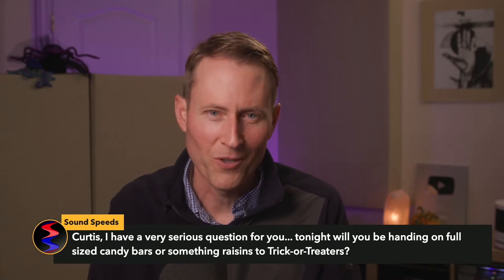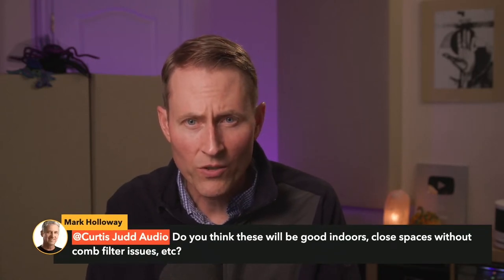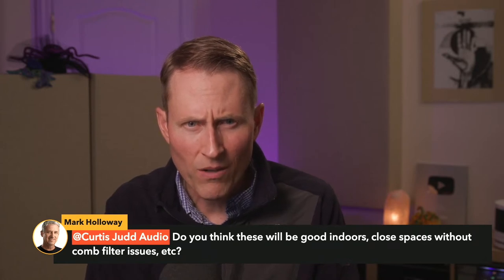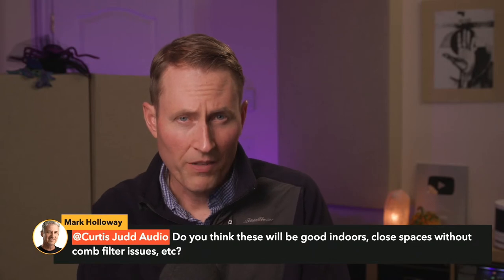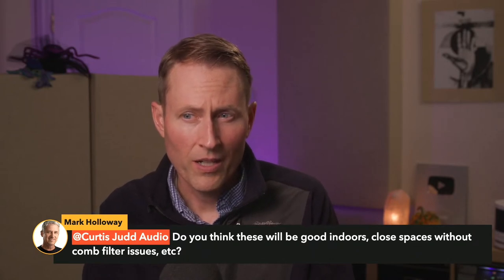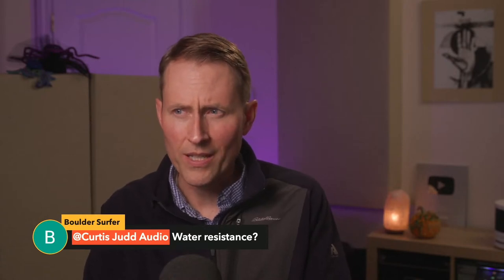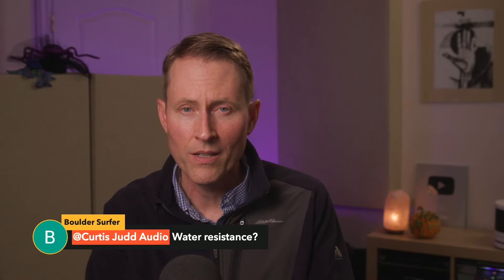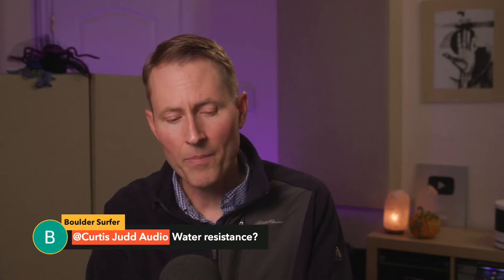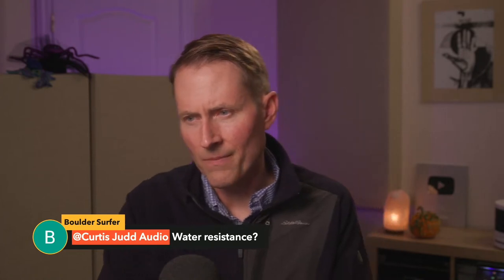So, answering your question, Mark, do you think these will be good indoors, in close spaces, without comb filter issues? I would expect them to behave like any other shotgun microphone indoors. So I don't want to overstate that issue. That issue doesn't happen very often. It's surprising when it does happen. And it can happen, but it's usually when the mic is a little bit off axis.